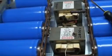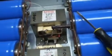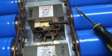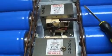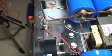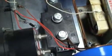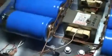Then a bridge rectifier — basically one phase from each transformer — rectifies the power. And the famous resistor that keeps smoking is still there, even though I have a huge beast to put in sometime. Another new addition is, I think they call it an IGBT block. The SCR fried a while back, so I've replaced it with this block unit here. I think it's rated for 1,600 amps at 1,200 volts. And it has not fried.